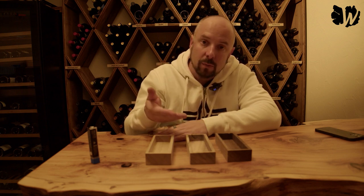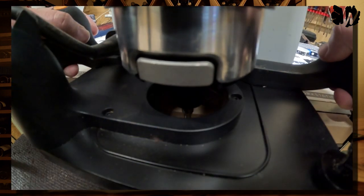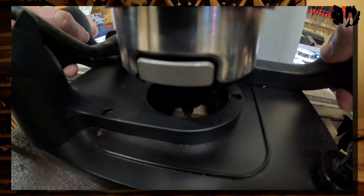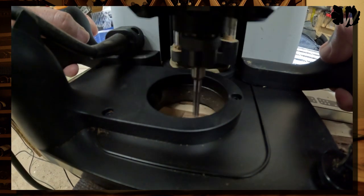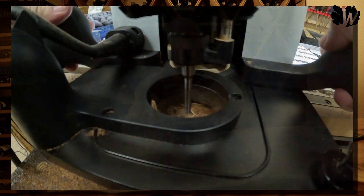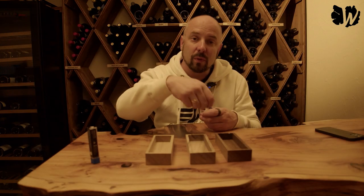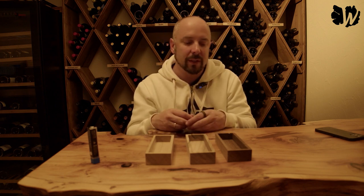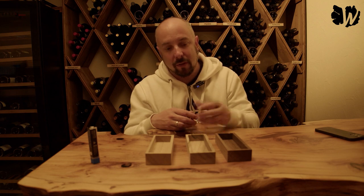Wenge is a tropical wood, much harder than walnut. Again doing 20 millimeter passes, and similar to the walnut but even more so, the Shaper Origin wanted to move away. With such a super hard wood and 20 millimeters of depth, it was hard — I had to apply a lot of brute force to keep it where I wanted. The dust collection got even more complicated; I had to do several steps to clean up the dust. There were chipped, torn-out pieces of wood that got stuck, so it was messier to remove that much depth from such a hard wood.